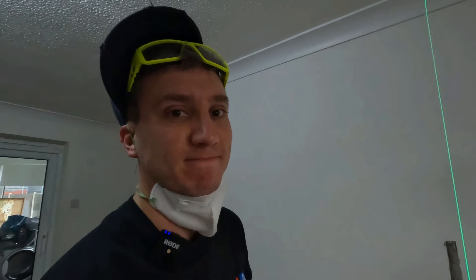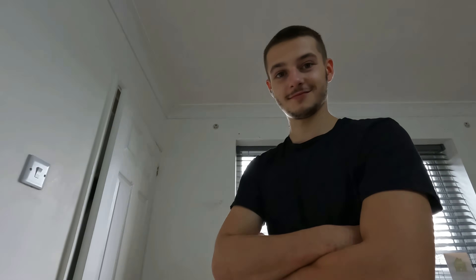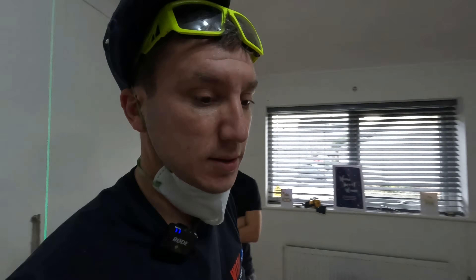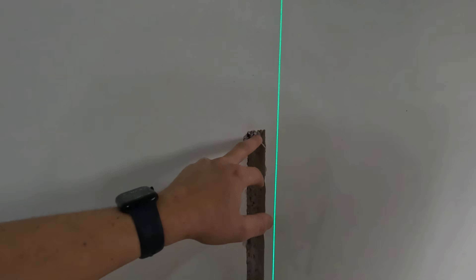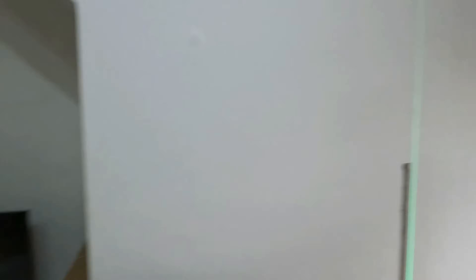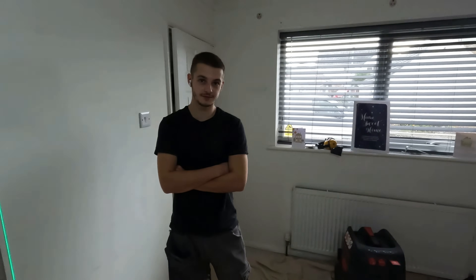How good was that chase! Pretty good — look how clean it is. We did start to snag a little bit; we hit the old cables. I thought I'd completely miss them but they deviate out of zone slightly. There's no dust in here — zero dust. There's a little bit of mess on the floor which the hoover will collect, but on an occupied rewire that is an absolute dream. We'll carry on going up; we've got one in that corner and a couple more over here to get in.